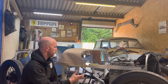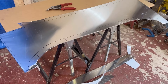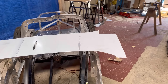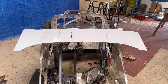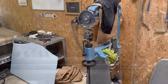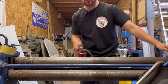There's less waste and it just makes the whole process a bit easier. So that's the panel all cut out. It's slightly different up here on one side because it's joined slightly differently as it's higher on that side. What I'm going to do is put the initial shape in using a roller — this is an old traditional way that I used to do it at Morgan and they still do it now. Once I've got the first bit of shape into it, I'll then transfer it to the English wheel. This is a really old school way of doing it — not everyone would agree about this process, but it's just how I'm going to tackle this job.